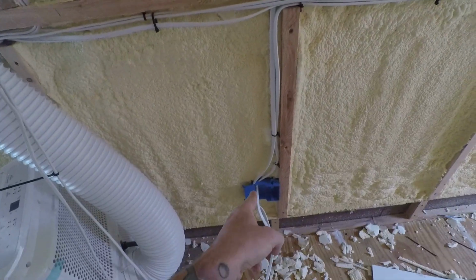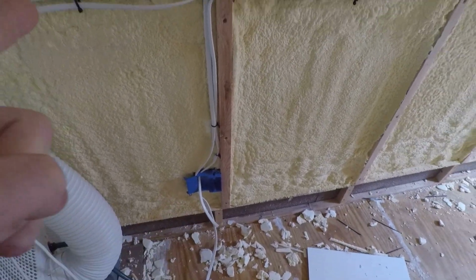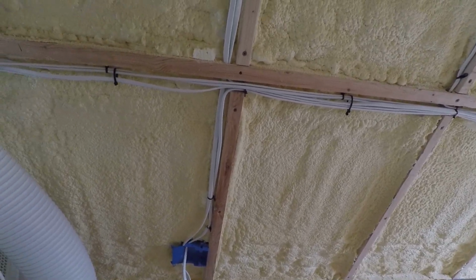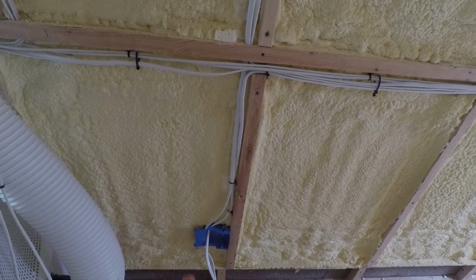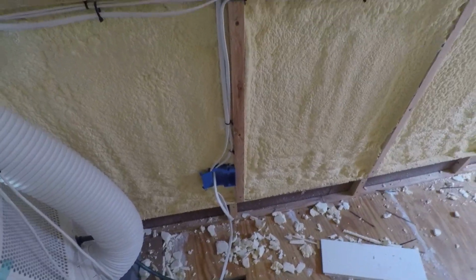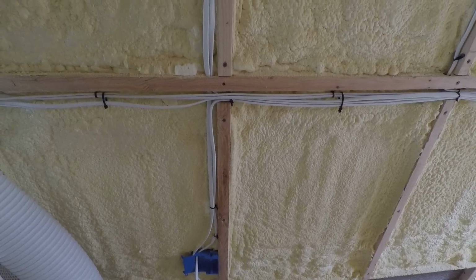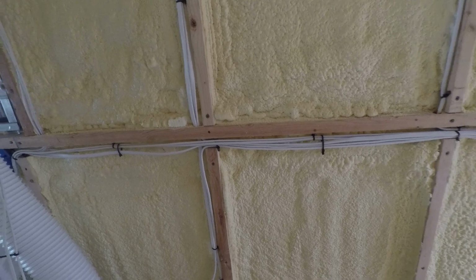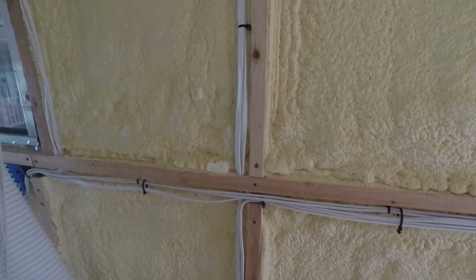And I put the fridge on its own circuit because that way I don't need to use a GFCI outlet, because GFCI outlets can have issues. They can get tripped by fridges. So that's why I'm doing that. As I mentioned previously, I put 12 gauge wire everywhere, DC and AC.